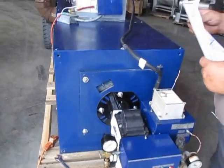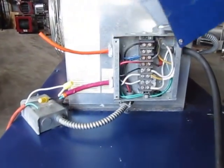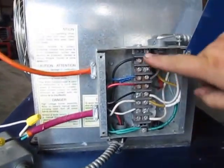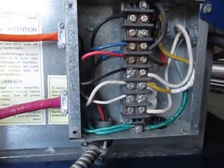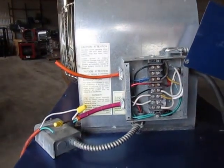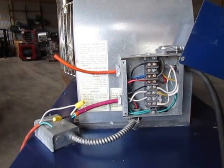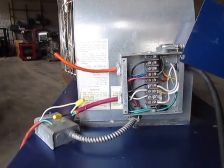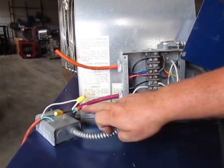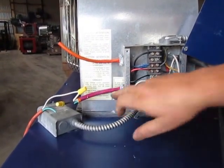The first category: components. Here's the heater junction power strip where the power comes to the unit from the circuit breaker and goes to the different places on the unit. The orange tail goes out to run your pump, and the purple tail is the power coming to the unit. Be sure you use a heavy enough wire coming to the unit.